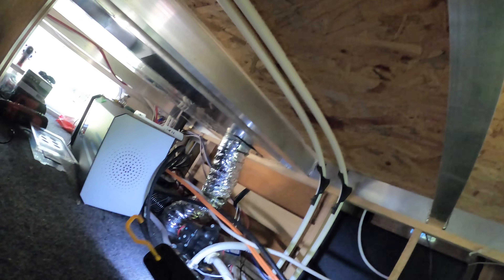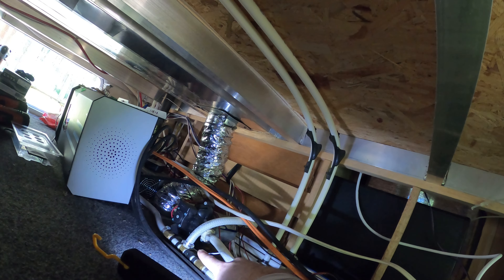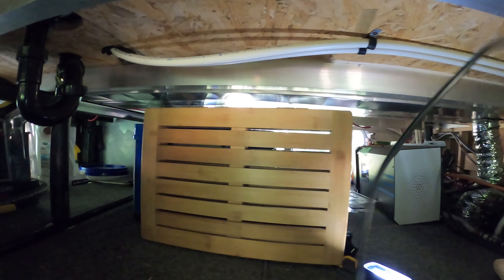I'm super happy about this because it's given me the kick to get into gear. Inside here is my water pump — just a 12-volt diaphragm pump — and this is the line going to the freshwater tank. I double-sided taped the sensor directly underneath the pump housing, so if that pump housing ever cracks or leaks, it's gonna drip right on it. I ran the line out to the edge where my battery switches live, and this is giving me the excuse to fix my battery temperature sensor, which couldn't reach the batteries where they were before. With these sealed batteries in the basement, I'll finally stick the temp sensor on the side.